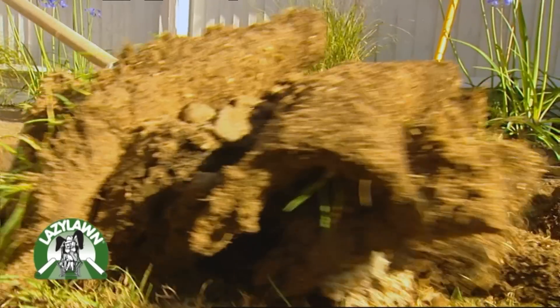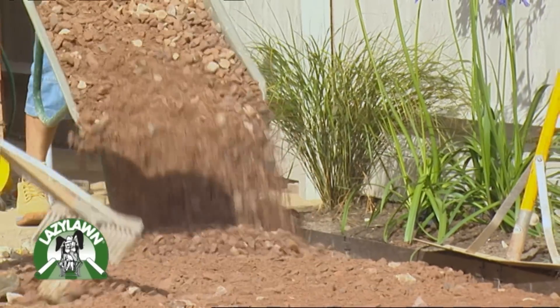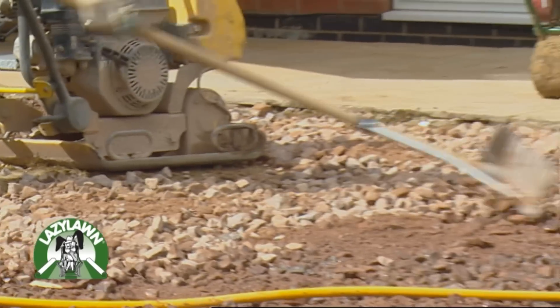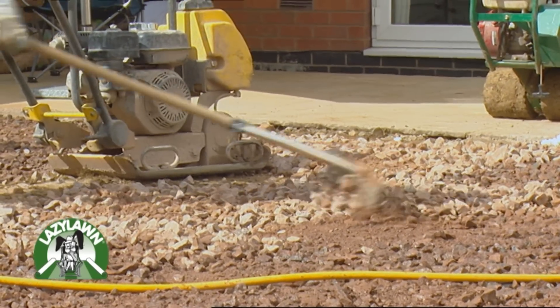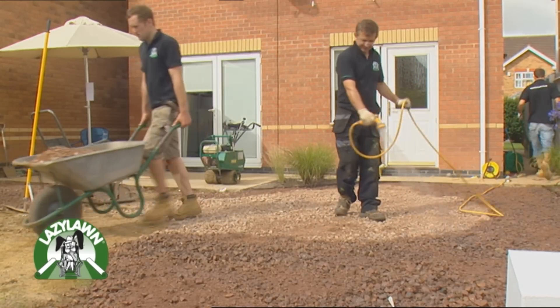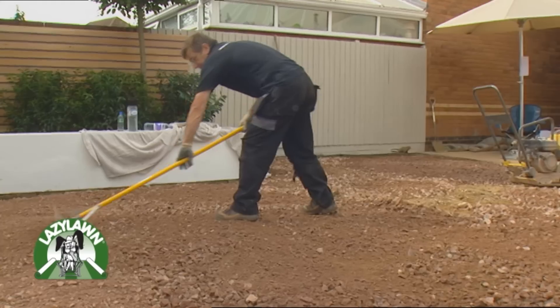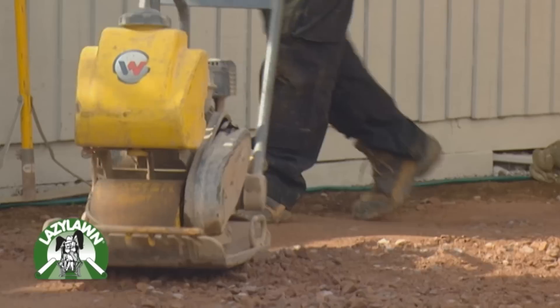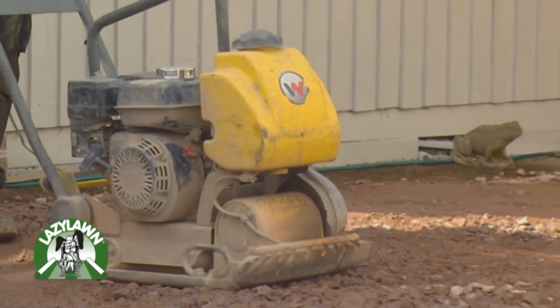During an install, we remove the turf and install a full-depth stone sub-base to ensure the area is stable. This offers many advantages and is far superior to a sharp sand base, for example. For soft soil areas, we will initially make the ground up with a larger aggregate material before the granite is applied.